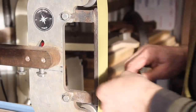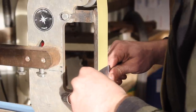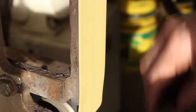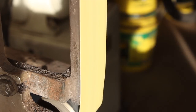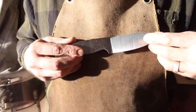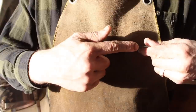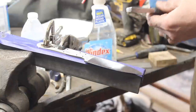Just working it down grit by grit — this is 120 grit here on the bevels. Ideally you'd go up to as high a grit as possible to avoid excessive hand sanding. Since this is a damascus or pattern welded blade, hand sanding is important to get a nice etch and finish. I went up to 240 grit on this blade and it turned out pretty good. No signs of the delaminations we had to deal with earlier. You can see the distal taper and the tapered tang there.